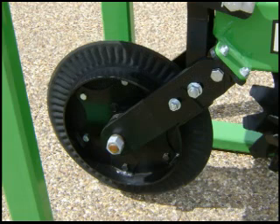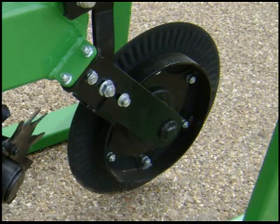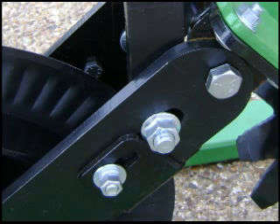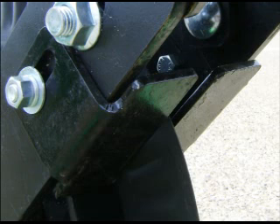The coulter slices through residue so the tools behind it can prepare a nice seedbed. The blade is formed from cross rolled boron steel for twice the life compared to high carbon steel. It's mounted on a large cast iron hub with a pair of big 208 series triple sealed bearings bolted on an inch and an eighth high strength steel axle. A depth band mounted on the blade rides on top of the soil and keeps the tool at a consistent depth. Notice the large mounting and pivot bolts that keep the blade square to the row. And there's an optional scraper to shed wet or sticky soil.